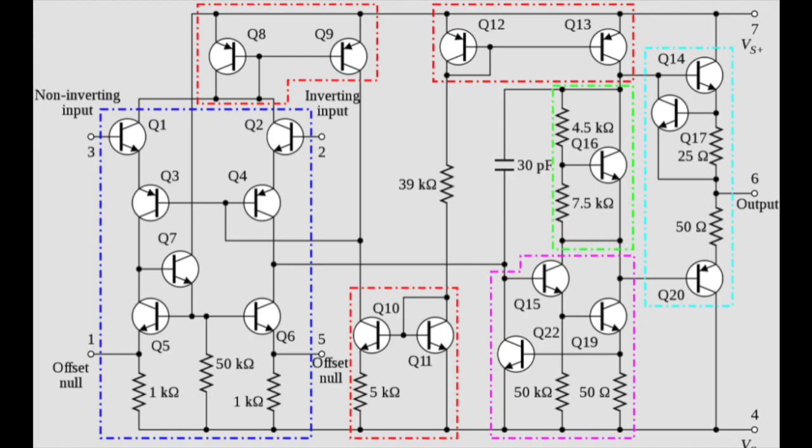AC coupling is a big mistake. Don't trust anybody that does AC coupling. If you look at a schematic of an op amp, your typical op amp has a lot of transistors in it and they don't do any AC coupling — it's all DC coupled. That's the proper way to do it. Back when I worked on radio in the olden days, they used tubes and had to AC couple everything. But now it can all be DC coupled.